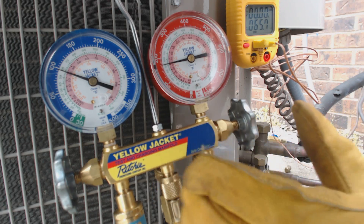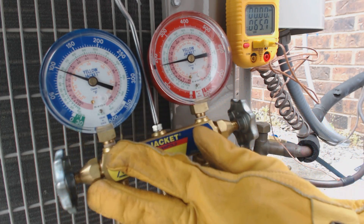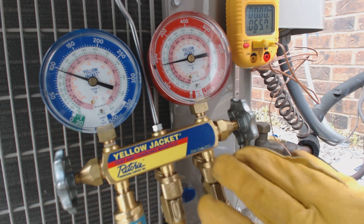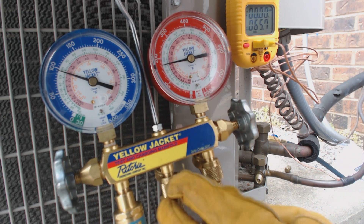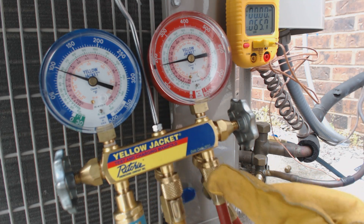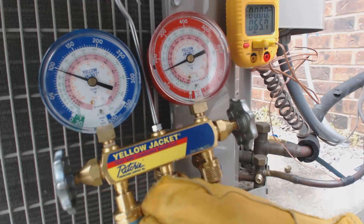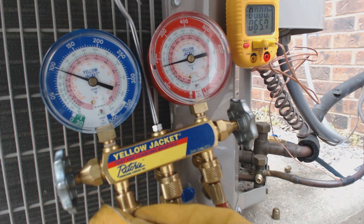Remember that this handle right here connects the red liquid line and the yellow service line. Now, if you walk up to this system, your gauge set should be at zero PSIG, which means when you put refrigerant pressure into the gauge set and hoses, you're going to have a little bit of air. So we're going to get rid of the air in the yellow line now, because both the red and yellow were empty. We had refrigerant come in through the red, connected it to the yellow, so now we're just getting any air out. You don't need to do it too long, otherwise you're going to have refrigerant come out.